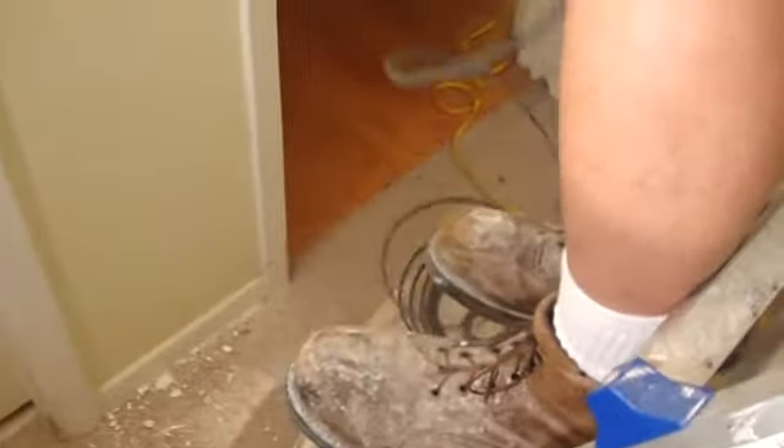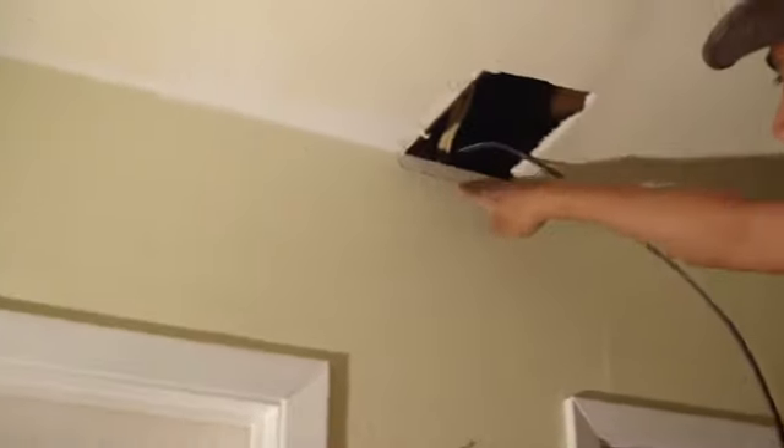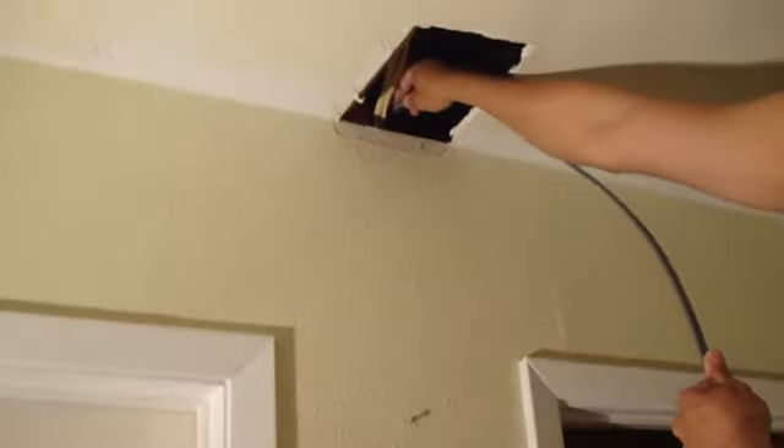Here's where the wiring is. I only had one wire — one switch that powered that fan. So what I'm going to do is go ahead and put another switch, a light switch that's going to power the recessed lighting I'm going to put in, and wire for recessed lighting. I went ahead and bought some wire at Home Depot and placed the wire down the wall, going all the way down to where the switch is going to be.